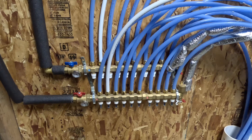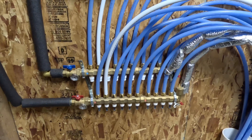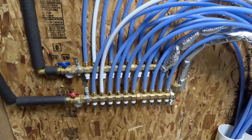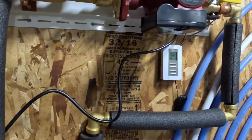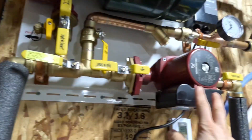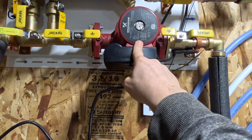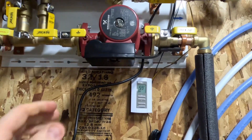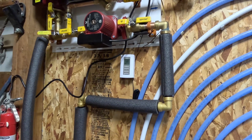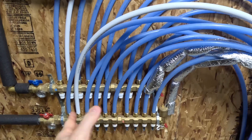The glycol isn't up to temp yet, and when it's really cold it's thicker, so I want to wait until it gets up to operating temp to really dial in the loops and make sure they're balanced so the whole slab heats up at the same rate. The lowest setting on this new pump has more flow — I'd say one and a quarter times more than the highest setting of my last pump. It's drastically better. The head pressure I think was like triple the amount.